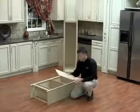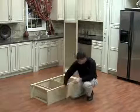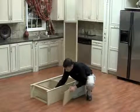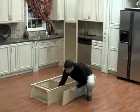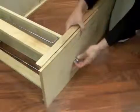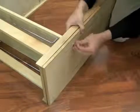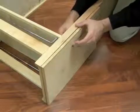Next, we're going to grab our floating back plate. Now, a little installation tip is you want to make sure that these slots are towards the bottom of your frame. So we'll go ahead and put our 1/4 by 20 by 1 inch flathead machine screws in. Go ahead and put our floating plate on. Then we'll put our tapered barrel nut on, and then we'll tighten.